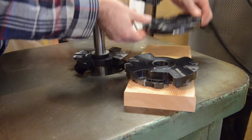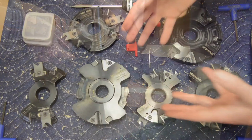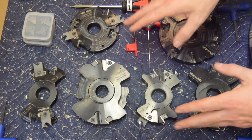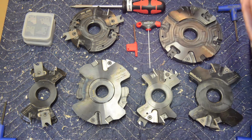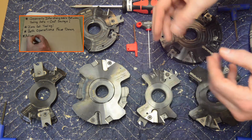That's about 3/16 to 5/16 of an inch. That's really nice because it gives you the ability to match your panel grooves to whatever flat stock you're using and deal with any irregularities in that flat stock. We all know that we can go to the store one week and buy a 1/4 inch nominal MDF and then come back 6 months later and it'll be slightly different. So having that infinite adjustability is really nice.